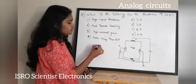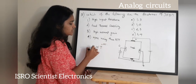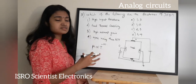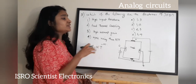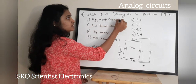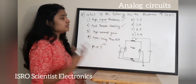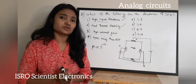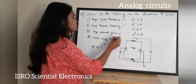The relationship between carrier mobility (μ) and temperature is: μ is proportional to T raised to minus a, meaning there is an inverse relationship. There will be thermally generated carriers in the JFET, but their mobility is inversely proportional to temperature, so the JFET has good thermal stability. Therefore, options 1 (high input resistance) and 2 (good thermal stability) are both correct. High current gain is wrong — JFET has a small gain-bandwidth product compared to BJT.